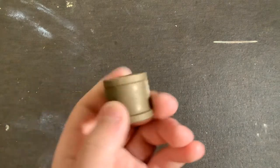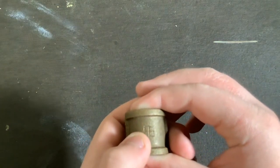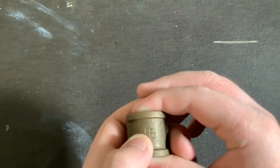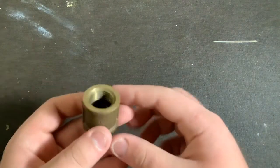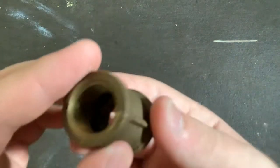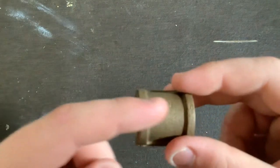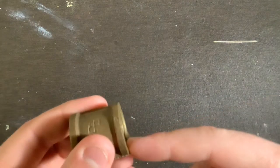The next fitting is this brass ITT Grinnell coupling. You can see there's the logo right there — it's a mysterious-looking double diamond shape with no real name for it. How this would work is you'd have a pipe coming out that you'd screw onto and connect another one. These are very helpful when running long runs where you need a really long pipe and continue on because the other pipe wasn't long enough. There are no stops inside, so you need to make sure you're screwing the pipe in the right amount — if you screw it in too far it would prevent the other one from screwing in all the way.